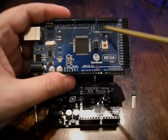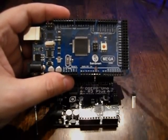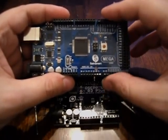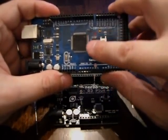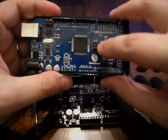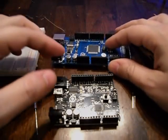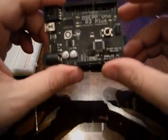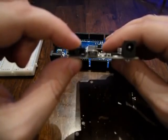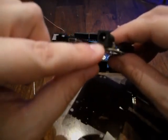These are transmit and receive pins. These pins can all be input or output, same with the digital. Analog pins are always analog in. Your reset button is here, and this pin header is for programming the bootloader chip — you won't actually use that. Same thing for this one up here.